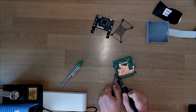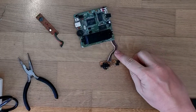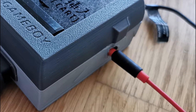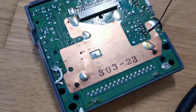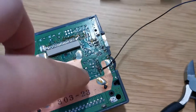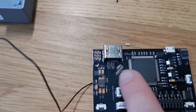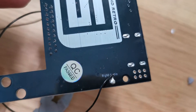Here is the consolizer case with a 3D printed cartridge holder and the internal spacer. We were brainstorming to figure out how to fit the DMG motherboard into its place. The main obstacle proved to be the mechanical off switch — we had to file it down on both upper and lower sides just to fit through the designated gap in the case. Next, we remove one of the daughter boards and short two of its terminals. The next daughter board is the stereo headphone jack socket. We analyzed the prospects and logic confirmed keeping this one should not cause damage to the hardware, so against the instructions, this is the creative DIY input that we propose.